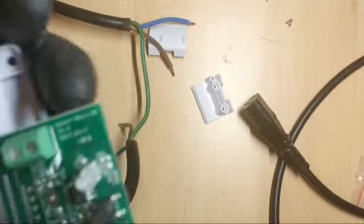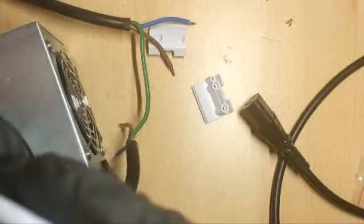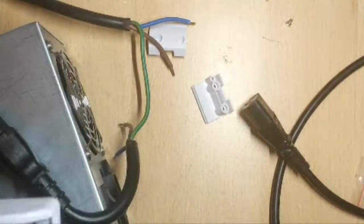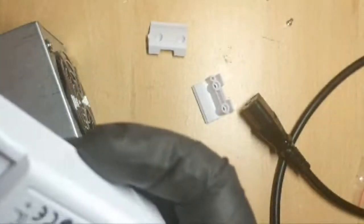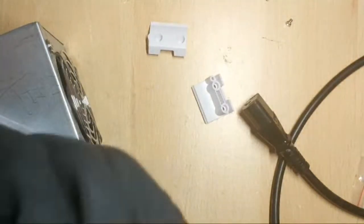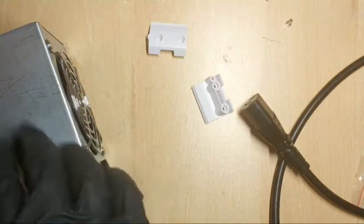But I would monitor, make sure you're happy with that 10 amps before leaving it unattended. If not, just go for the 16 amp version to be a bit safer. But when you see rated at 10 amps, only use 80% of the capacity, so I would say don't go higher than 8 amps when running 24/7.